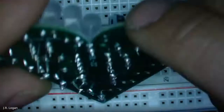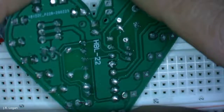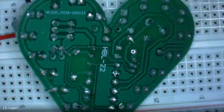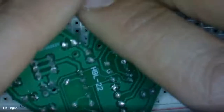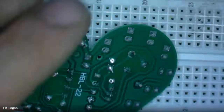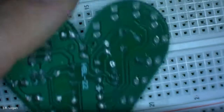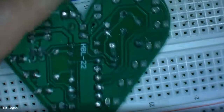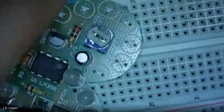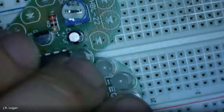Then after that, you're going to use a piece of software. There's software out there called Circuit Maker that we've used to make something. It's a website. There's also Eagle, which is by Autodesk, and that's very popular. And that's now integrated with Fusion 360. What those will allow you to do is typically have one part where you design the schematic. So you design all of the elements: what are the components that are going to go into this, and then how are they going to be connected, but not how that is laid out.